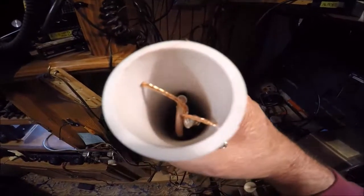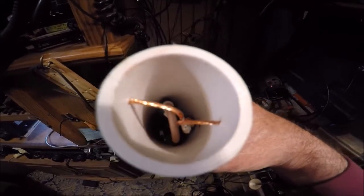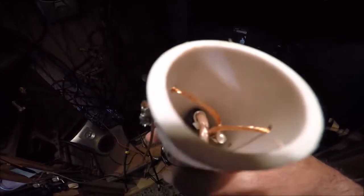If you look in there, you'll see the two leads that go to your wire antenna. If you look closely, you can see that those two leads are touching each other right about where that solder join is. The two leads are actually touching — they're not supposed to touch each other, because they carry on down to the coax connector on your 303 with the beads on it.